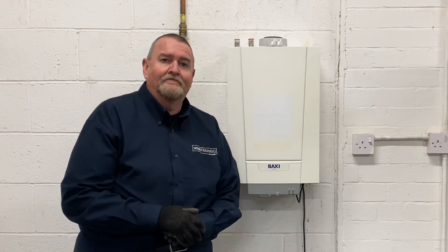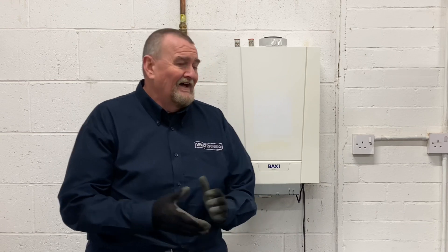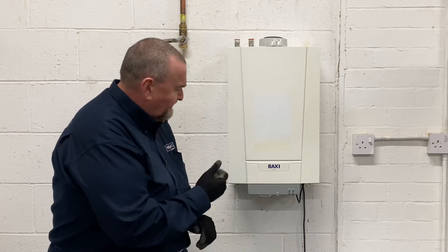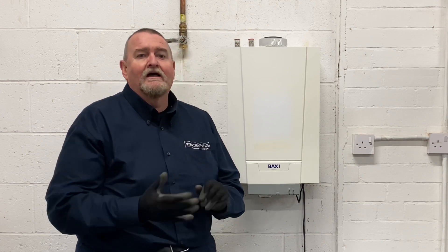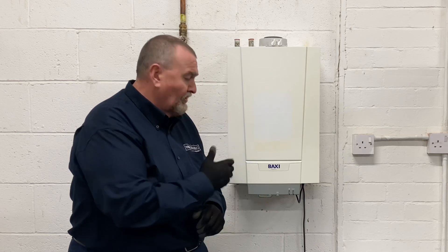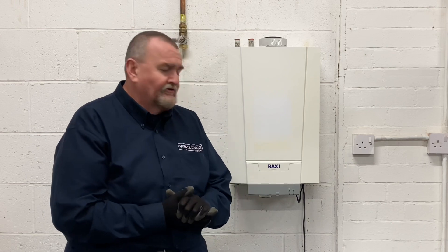Hi guys, it's Roy Fugler here at the Viva Training Academy over in Halifax. Today we're going to have a look at a heat only boiler. We've done videos on combis — a heat only is a more compact boiler. The hot water is heated via a cylinder, typically fitted to S&Y plans. This particular model is a Baxi main eco. It's an early version of Baxi's heat only boilers but it's the same internally as the Baxi 800, the Baxi 600, the Baxi eco blue, the Potterton Suprima and the main eco compact heat range. So anything we go through on this one, it's exactly the same on those boilers.